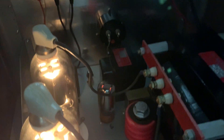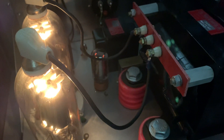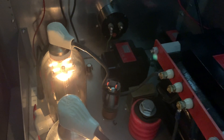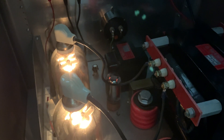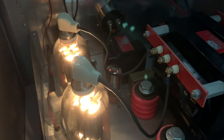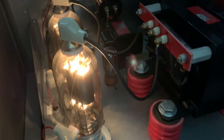I'm going to regulate that supply. My plan is to remove that 5R4, solid-state that out, and then regulate that supply — because that 5R4 is rectifying the bias supply for the 810 grids. I used to have a 5V4 in there and it kept blowing up; kept shorting them out, had to put a 5R4 in to stop it, plus add a cap to ground to keep oscillations off it. It yanks that supply all over the place when you modulate, so it needs to be regulated.